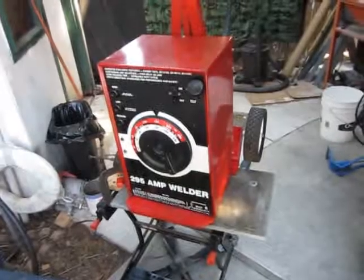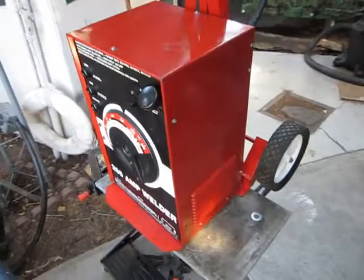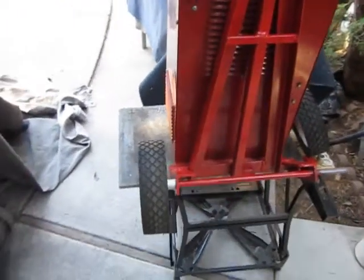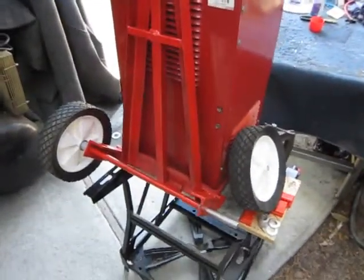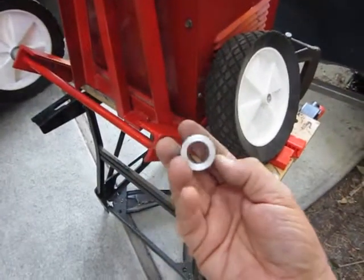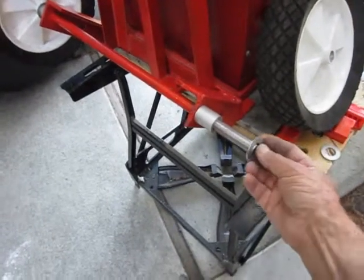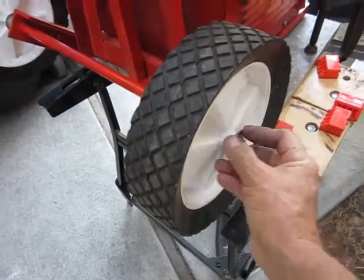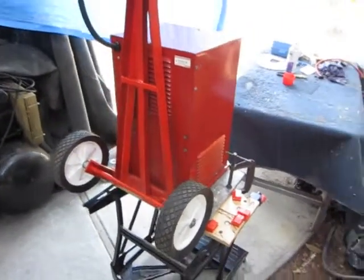Pretty far along — the welding machine is now on the stand, the cart, and we're just putting the wheels on here. Looking pretty good overall. I painted the cart to match as close as I could — out of scrap steel, not a bad use or reuse of what you have on hand. The axle I left a bit long, and then I also bored a bushing on the lathe, a little over 5/8-inch inside diameter. It doesn't matter how you do this part of it — it's just the way I do it — and then a washer and, of course, a wheel going on, then another washer and a cotter pin to go through there. After I get that, I'll be taking it off the stand and we'll see how it rolls.